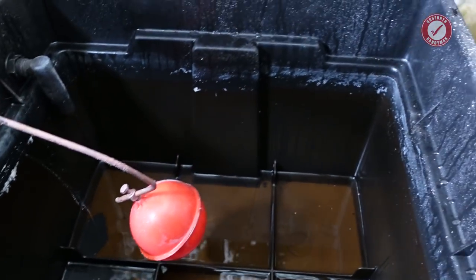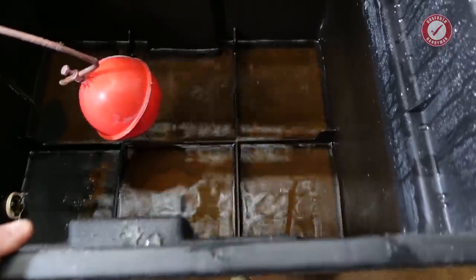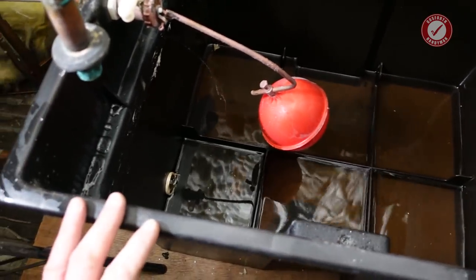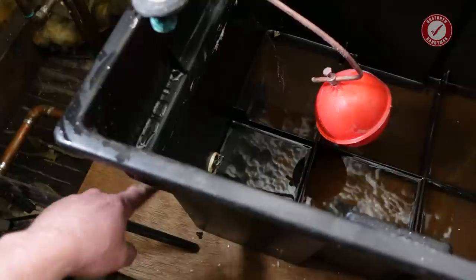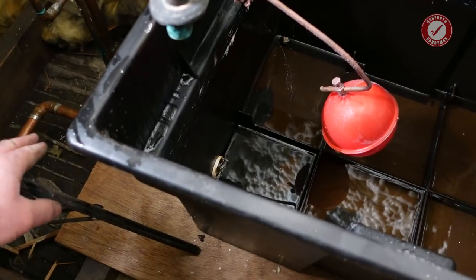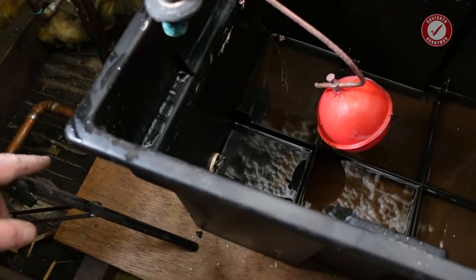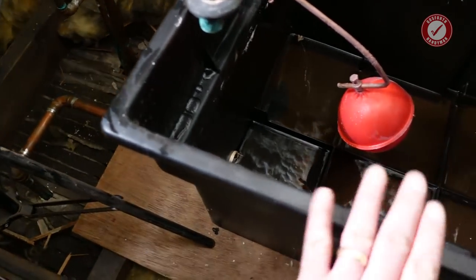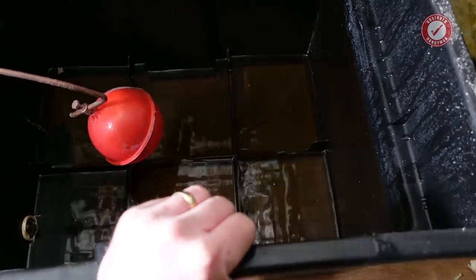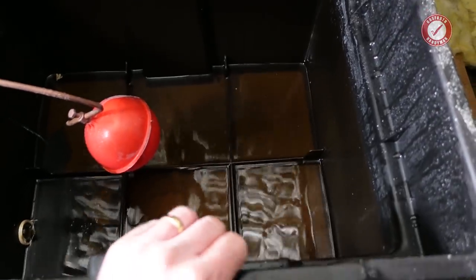You can see we've got a little bit of water left in the bottom of this. This is actually quite a new tank - that's going to be tricky to move as there's quite a lot of water there. I think what I'm going to do is disconnect everything apart from the feed out at the bottom. I'll cut the feed above the hot water tank in the airing cupboard and then drain out what's left into a bucket downstairs. I don't want to try manhandling this out of the loft hatch with a couple of inches of water still in the bottom.